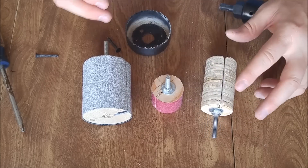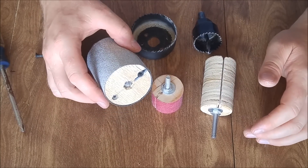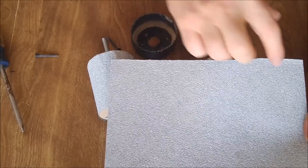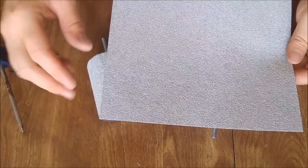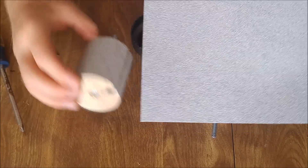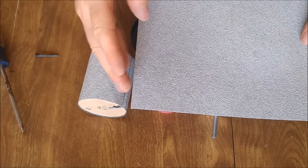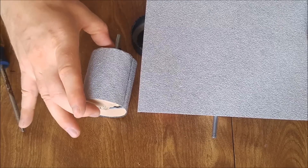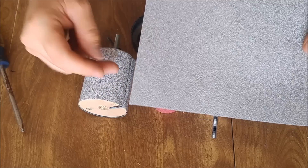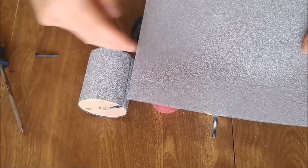For this big one, I used a two and a half inch hole saw. This is a partial sheet right here — the 9 inch width here and the 11 inch dimension there. The diameter of this spindle is sized so that it uses the full 9 inch width, and the height here is a little bit less than 3 inches. So you only need to mark and cut the 3 inch dimension and not deal with the width dimension.